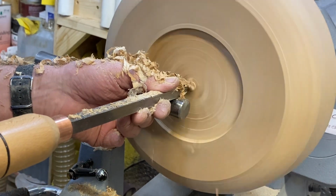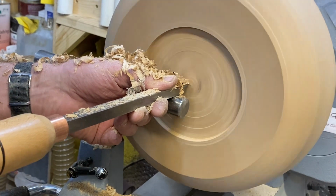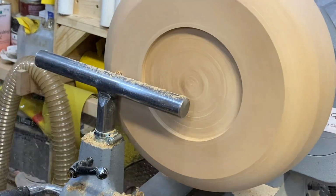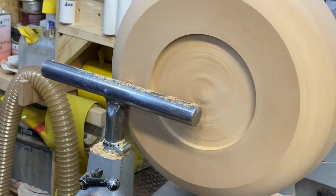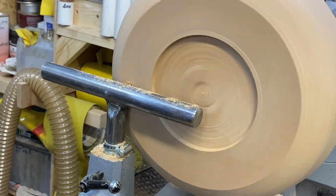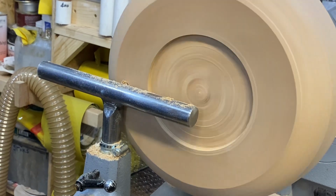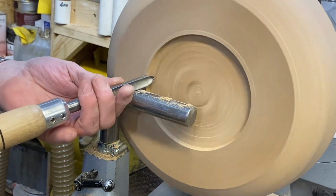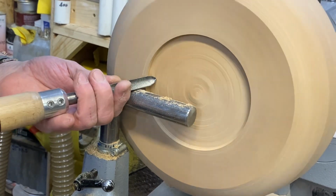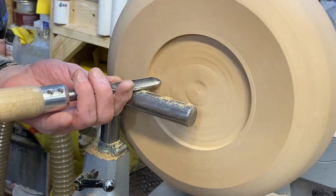High on that, a little bit high for my center. Okay, but you can come in with your square and just go across like that. Now I could scrape it at the bottom. I'm not. I'm going to come in here, and I'm actually going to come in. I've got my spindle gouge here, so I'm just going to come in, pick up the cut,